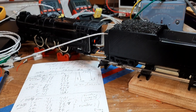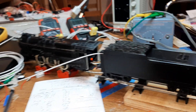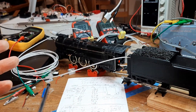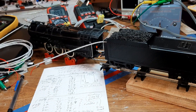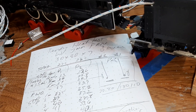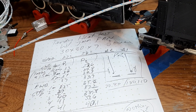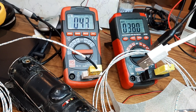The engine's been running about 30 minutes or more, and I've done some tests at 50% in forward and reverse and 100% forward and reverse. The hottest temperature we got was 44 and 41.5, and we're sitting right now at 43 and 38.